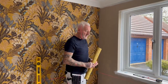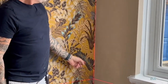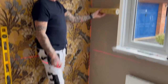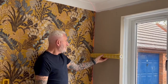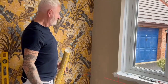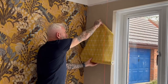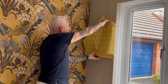There are a couple of things we need to do. You can see in the corner now I have my laser level on. This corner is perfectly straight. I've checked it, so what I can do is come away from this corner, running the paper tight into there, knowing that it's straight. I can keep my laser line here so I can keep an eye on when I drop the paper down. That level will be through a pattern and if it's running out one way or the other I can adjust the paper.